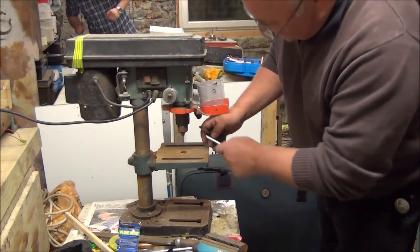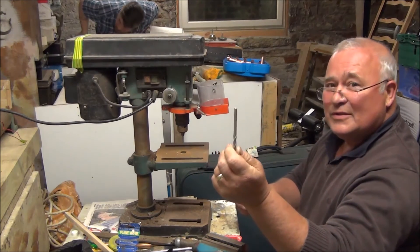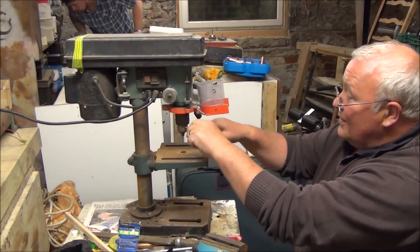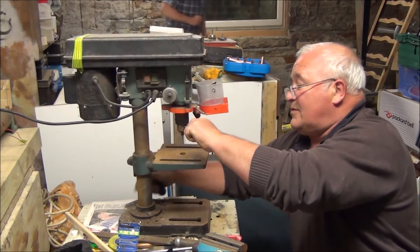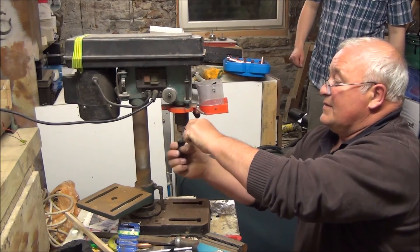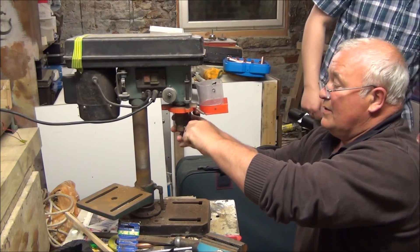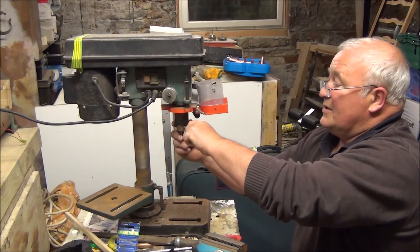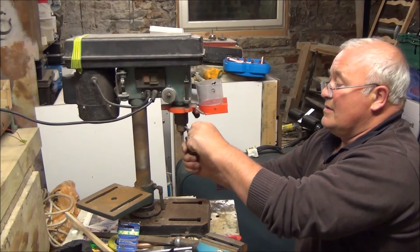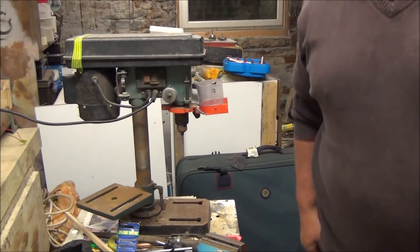Just a little tip from Bob's dad: if you can't find your chuck key, you can use a suitable round piece of steel — such as a drill bit that just fits in the chuck key hole — and a straight screwdriver. Drop the plate out of the way and leave the chuck open in such a fashion, then if you need to change the drill bit, go the opposite direction to tighten it up. Works every time — you know how pesky those chuck keys are for getting lost.